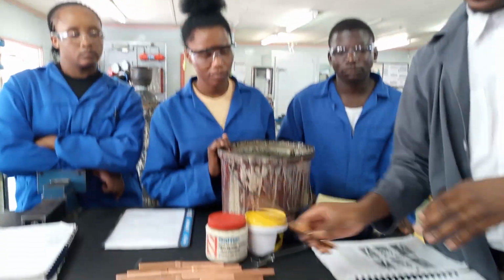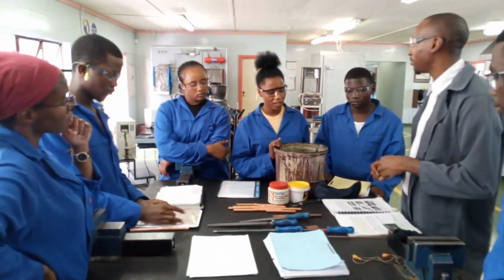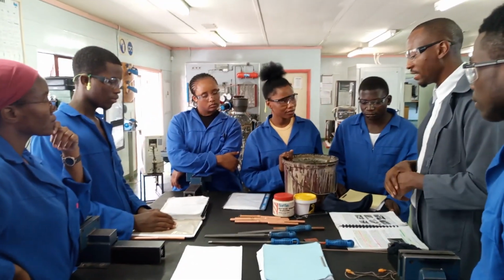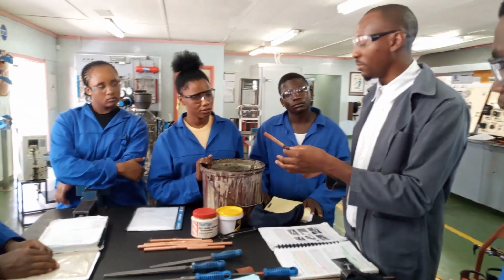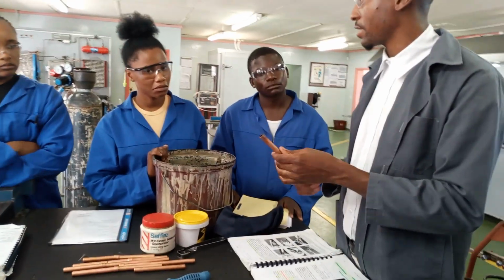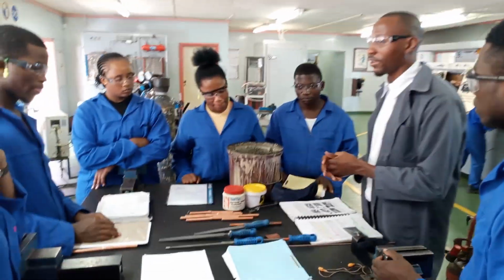All right, so any further questions before we do it together? Yes, Katrina? Why do we apply flux? Yes, flux is to prevent oxidation. So after cleaning, because your flame is not that strong, you just have to apply flux to prevent oxidation. Yes. So, okay. I believe there are no further questions.